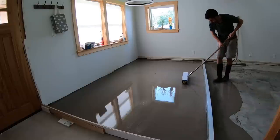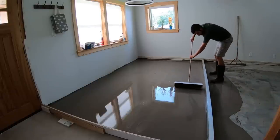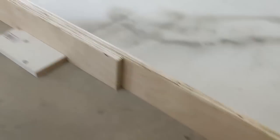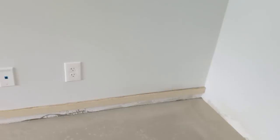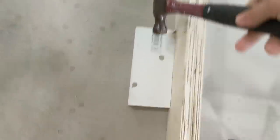To make these rails, I ripped down some plywood to be the same width as the box screed, then used scrap pieces of wood hot-glued down to the floor to secure them in place. Against the wall I just tacked in a strip with some finishing nails. Once you're done, you just pop the pieces of scrap wood off with a hammer — it comes off pretty easily, but the hot glue is strong enough to hold everything in place.